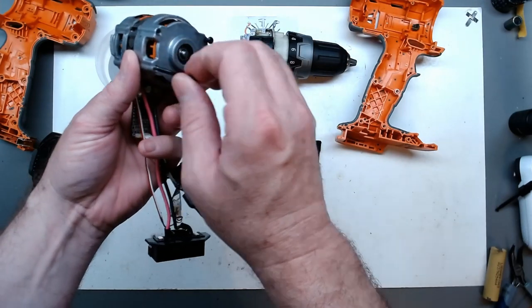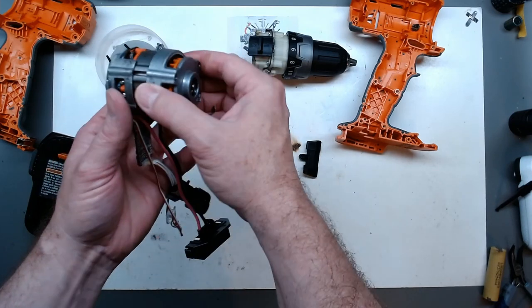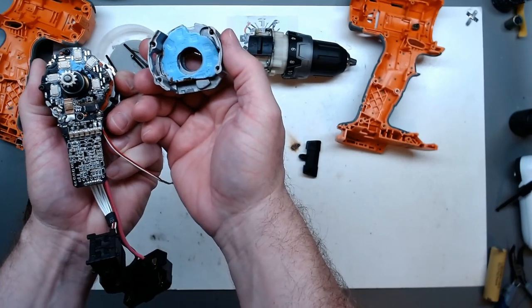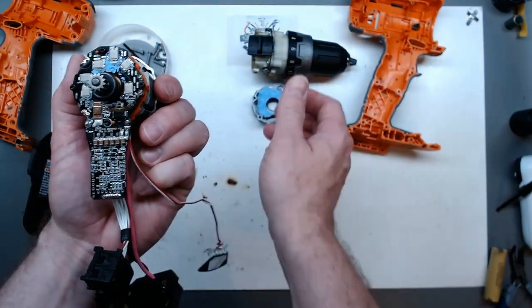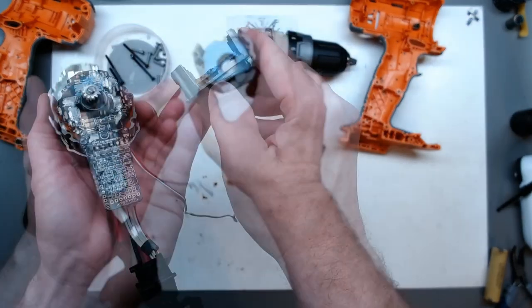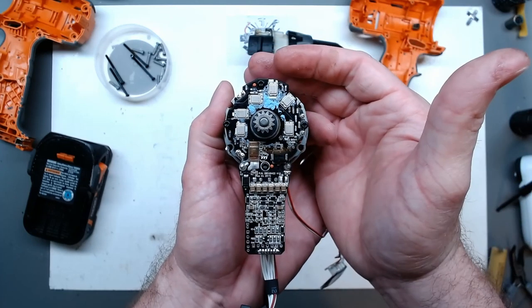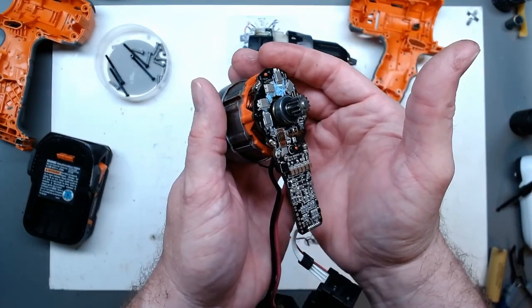At this point the motor doesn't work anyway, so it's probably worth taking a further peek at what we can do. I do see some type of water line — like maybe water came up to this point here. Look at those transistors. Should be six — yep, six of them. So this is going to be a three-phase type winding.